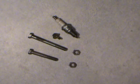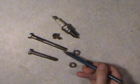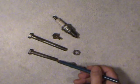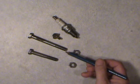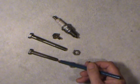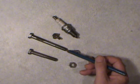Welcome folks. Today I'm going to be talking a little bit about nuts, bolts and screw threads in general. The first two examples are mostly used in the United States of America. They were used in Canada up until about 1976. In 1977 we went to the metric system. These are inch system bolts. This one with the coarser threads is a national coarse series and the one with the finer threads is a national fine series.